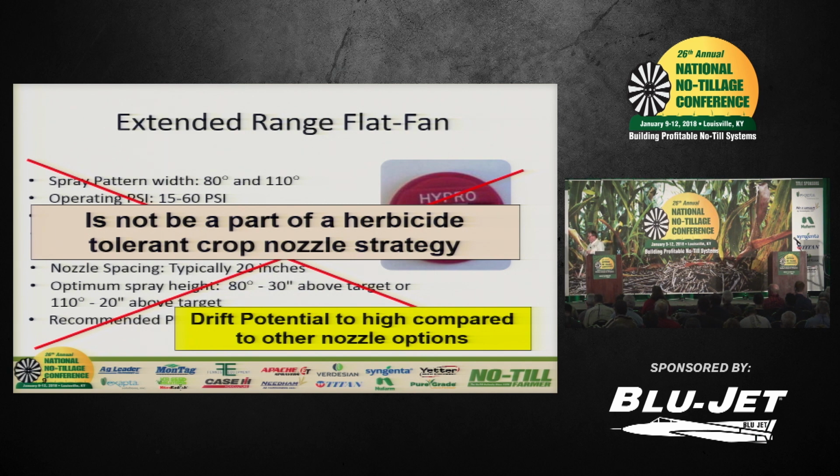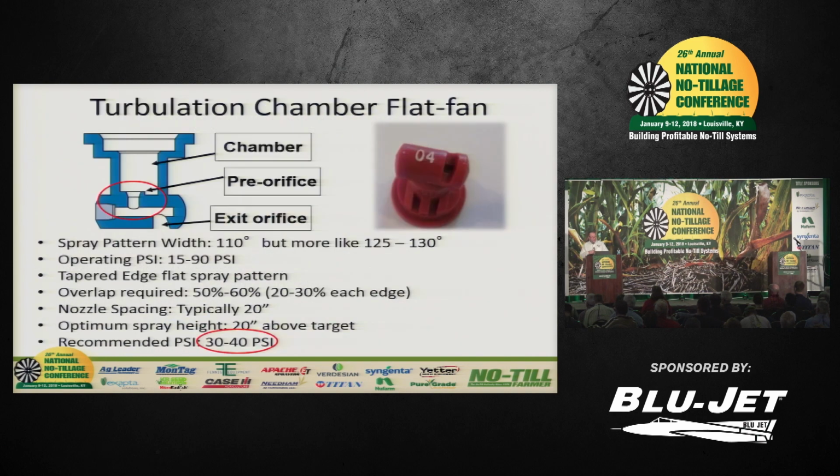Okay? Let's move to nozzle number 2 in my discussion today, and this is the one that's just under 30 years old. It came into play after I started this career, so I followed it from the beginning. In fact, I was one of the first researchers that put this in the field and tried it against various products and efficacy. This is the turbulation chamber flat fan. It's available from TeeJet. It's a design of theirs. It has a chamber, it has a pre-orifice, it has a secondary chamber and an exit orifice.